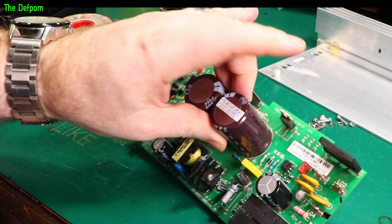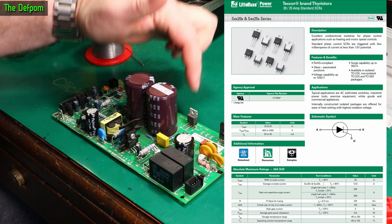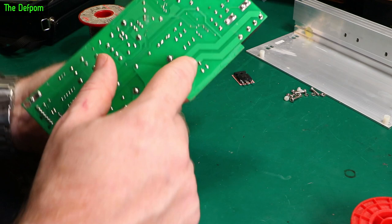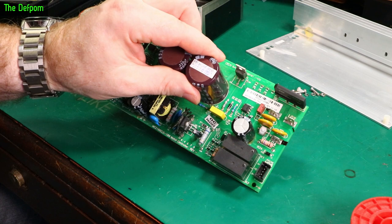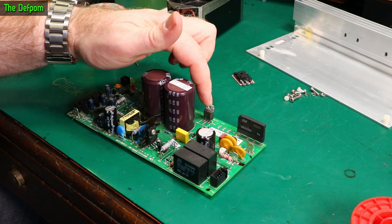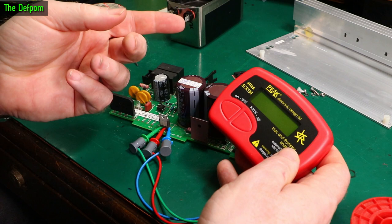There's also this device here marked as S8025L — I'm measuring 50 ohms from pin 1 to pin 3 both directions. The centre pin is the input. I think pin 3 is going to be the gate — I'm guessing it's a MOSFET of some kind. There's an optocoupler nearby — MOC3052A — so I think this is actually a triac. I'll put my Peak SCR100 on it to check. Is it a triac or not? Let's find out.